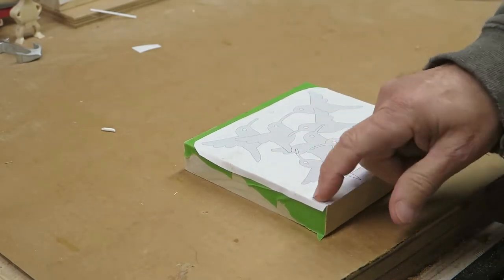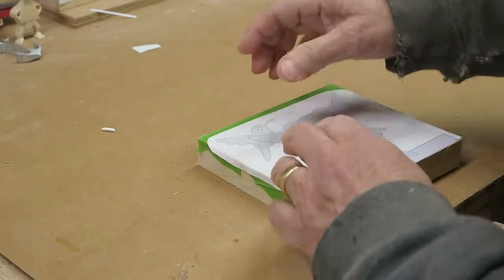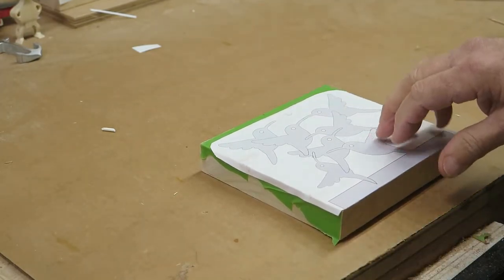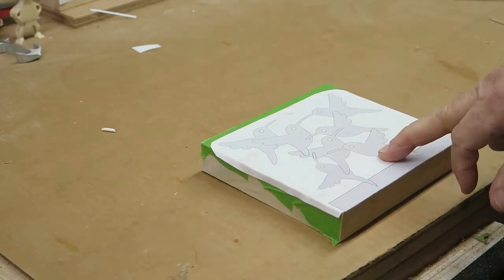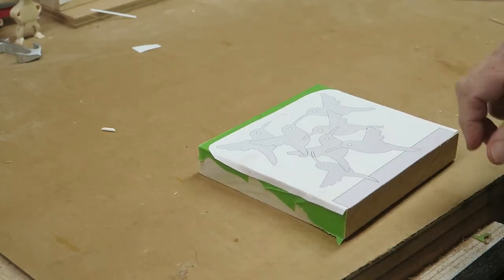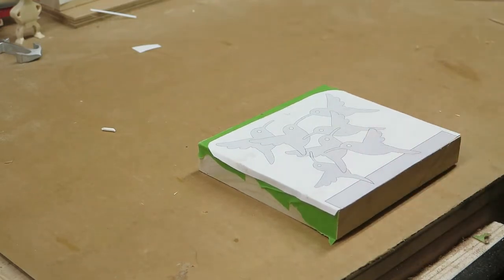Now I could just start cutting outside and cut in there, but then as we go along, the thing might start to get a little bit loose on the scroll saw, so I think we're better off if we put one entry hole to start it out there. Okay, so I'll do that, and I'm going to go drill out the eyes, and I'll meet you over at the scroll saw, and we'll get to work on cutting this thing.